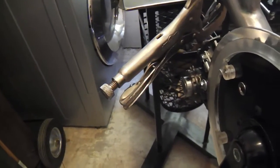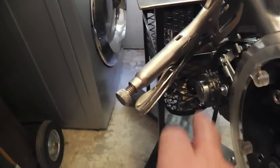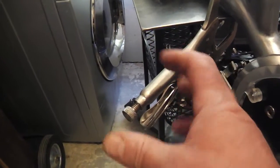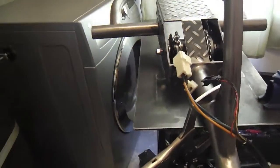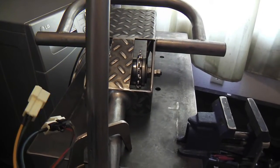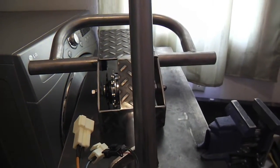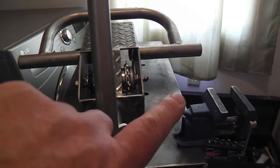The Bafang may not have that, and the geared hub motors have their clutching mechanism inside the hub motor as well — it's a weak link. But this wouldn't be a problem; if you ever had a problem with the clutch here it looks like it's all steel and very robust. I like that it's not internal — it's external, very easy to diagnose, locate, or replace. It accomplishes the defeating of the magnetic drive, which is important because direct drive hub motors don't have that defeated — they have fewer moving parts which is a plus, but you're always fighting that magnetic cogging drag.